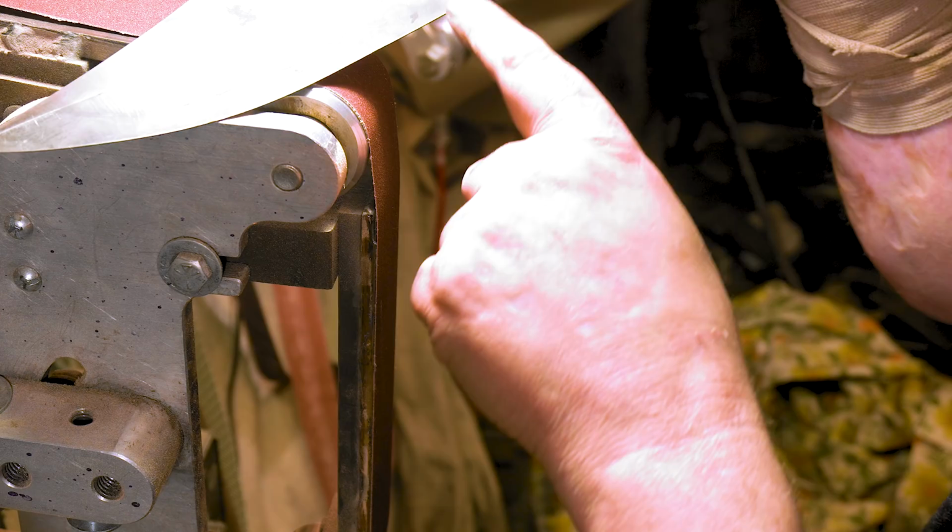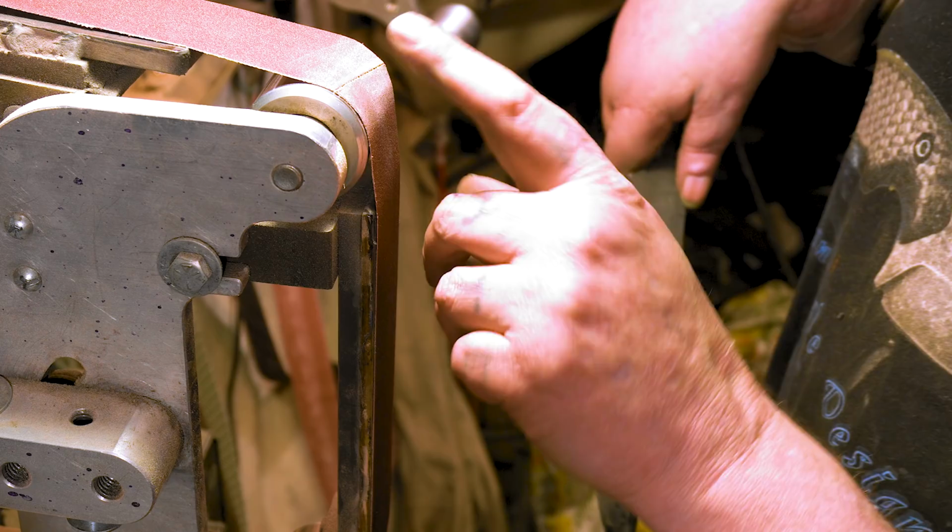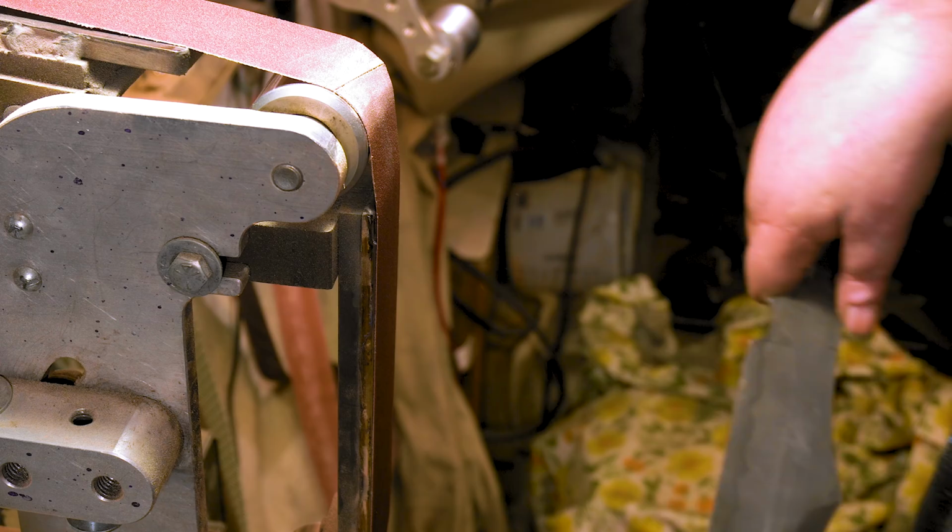We're gonna start with the 240 here, because once I etch this, you can see some of these lines are pretty thick. The reason I always used to skip from 120, or I started skipping from 120 to Trizac, you gotta knock down these 240s. Trizacs, you don't have to knock down the seams. But let's just get on it.